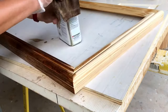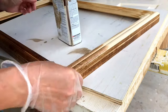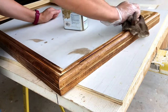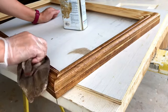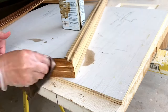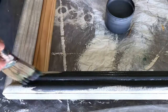Here's a little trick I like to do on pine furniture: Danish oil soaks into wood and hardens it a bit, making it more durable and resistant to dents. Pine is pretty easy to dent, so I like to apply Danish oil even when I'm going to paint, on any pine or poplar project since they're softer woods. You don't have to do this, but Danish oil will slightly harden your pine projects. Just let it dry completely and wipe away any excess before you paint.